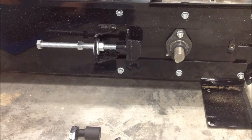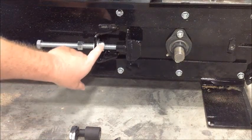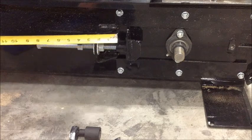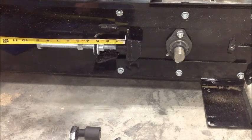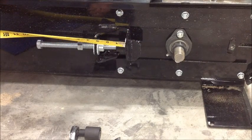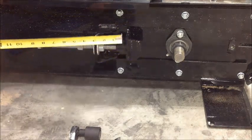Now we've moved to the other side of the conveyor. Before I came over here, I measured the distance between these two points. On the other side we were at three and one-eighth of an inch, so we're off an eighth of an inch on this side. Keep in mind this is a brand new conveyor, so there shouldn't be much adjustment needed. If you've run a full season, you may move this one to two inches down to get the proper tension.